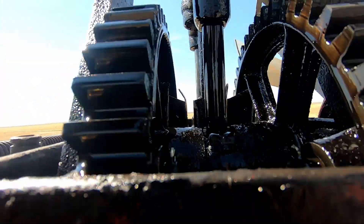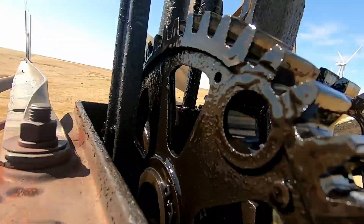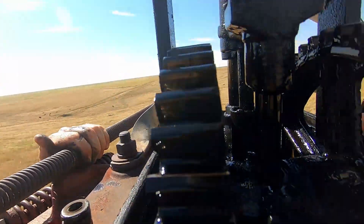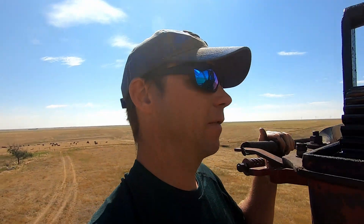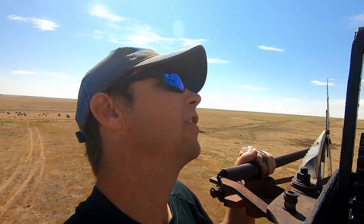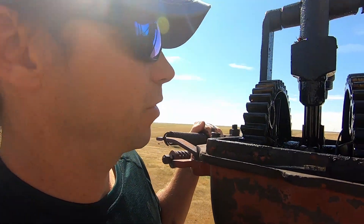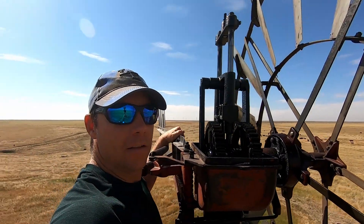Let's go ahead and let the wind grab this for a second. If you look again here, there's another hole right across there — there and there. I could put it in those, but it's not worn out enough to justify doing that yet. So I may just leave it for the rest of the season and catch it next spring. That's what causes a clank in a windmill.